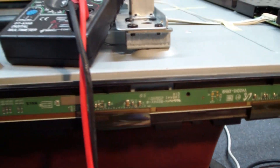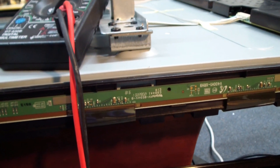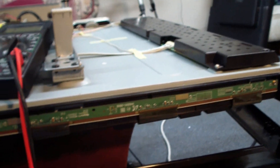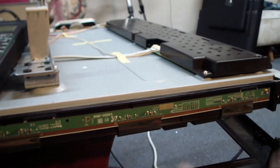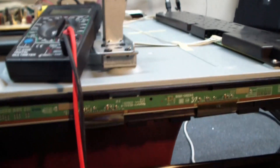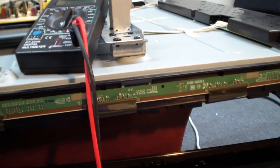What I'm really hoping is that one of these capacitors is shorted. That's all I've got left — otherwise it's an internal short inside the panel. The only way to know is to take off these three capacitors. By the way, the circuit board on the other side has the same kind of capacitors and those measure infinite. So there's definitely some sort of short on this side. If it's not a shorted capacitor, it's time to throw this thing away.